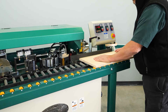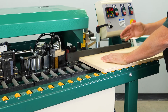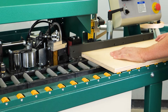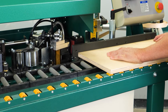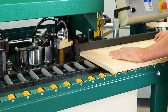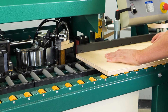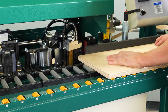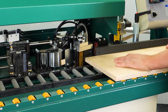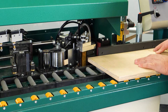The first piece of contact will be a rubber roller which advances our tape through the system as the board is passing through. It'll also make contact with the first switch that closes that contact and lets the machine know that the board is passing through. The next item into contact is the glue spindle assembly, which will then apply glue to the edge of the board on the inside.